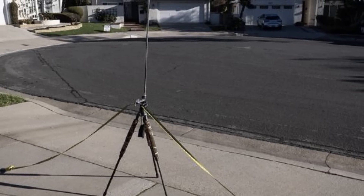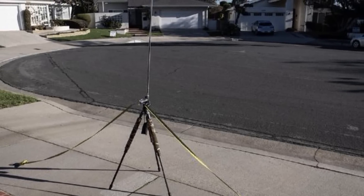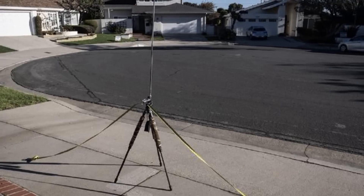So what are we going to look at today? It's an idea that W6QR sent to me. I've put a picture up of his antenna outside his house — a vertical antenna with radials, two radials made from tape measures. I thought that was quite a good idea. I think I may have seen it before a long while ago but completely forgotten about it. So thanks, Bill, for sending me that idea. We know that an elevated vertical works better than one on the ground — you get a significant improvement in performance because you reduce earth losses. This is quite a good idea, so I'll try it out.